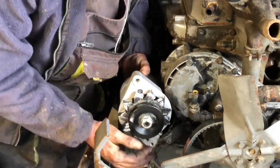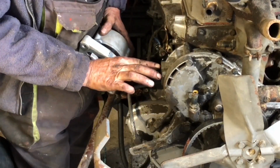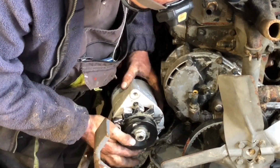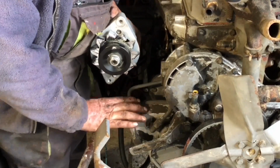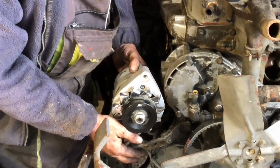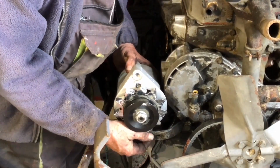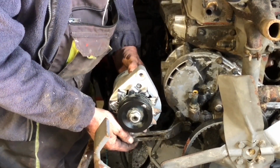so that we can have this. It has to bolt in there. You can't see this, there's two holes there. It has to bolt in there, and then you have to have movement on this bar here in order to be able to tighten and loosen the belt without interfering with any of this. You can't rub on it, you can't touch it. So that being the case, I need the alternator there. Am I going to get enough? And we're going to have to order a special belt.